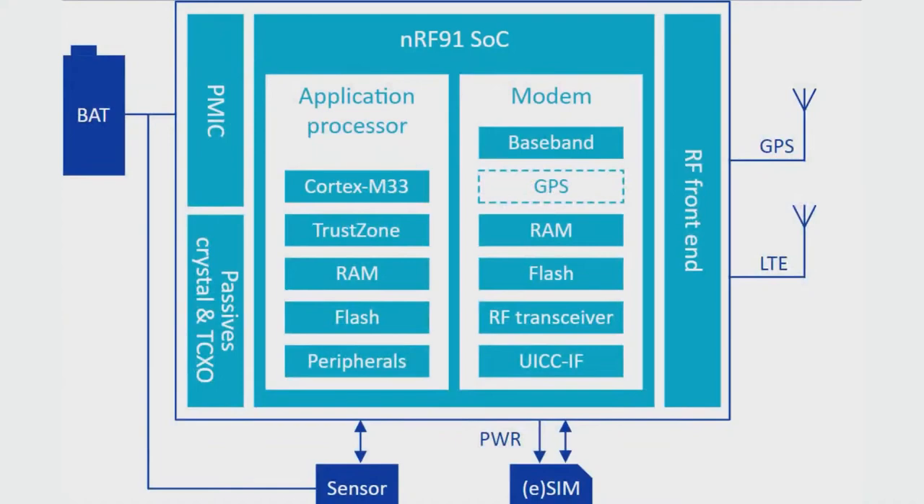Inside, it is a SIP — a system in package. It's not a chip but a very thin module that's chip-like. Inside you've got the standard Cortex-M33 ARM chip, and then you've also got the modem, which connects to the LTE and GPS network. You of course need an external SIM, but everything else is integrated together, including a temperature-compensated crystal and the PMIC. That means you don't need a lot of external components, and you get all the Cortex-M33 peripherals you'd expect — analog/digital inputs, I2S, PDM, PWM, and 20-plus GPIO.